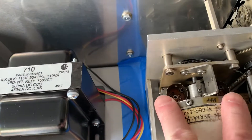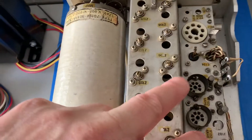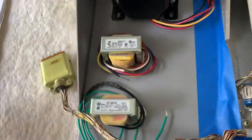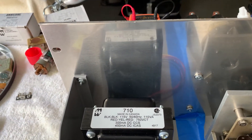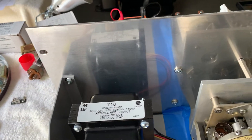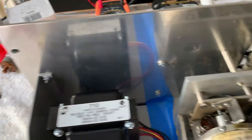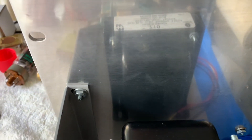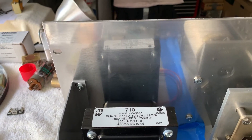So I'm going to have a separate DC regulated supply to power up these two tubes in the oscillator, then this other transformer to power up these three tubes separately, then another smaller separate one for the 6000 tube. I've got to figure out how to make all this stuff fit. I thought I'd put a meter for the negative keep-alive supply, but once I get the voltage on that set, I'm never going to mess with it anyway. I'm thinking I should really have a plate current meter on this 6000 tube — just to monitor the plate of that driver tube.